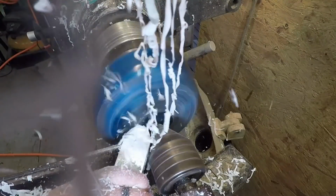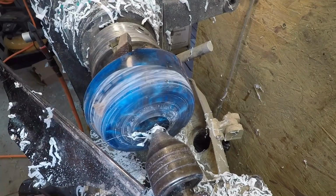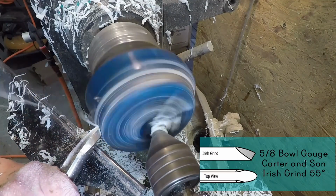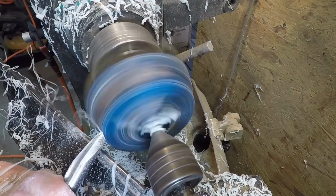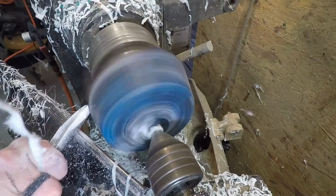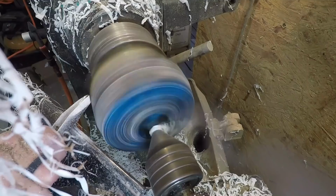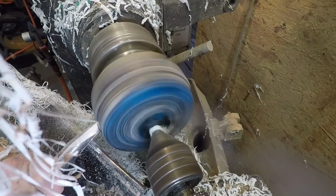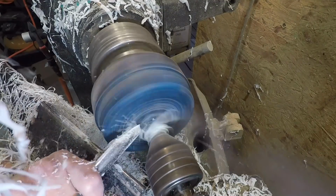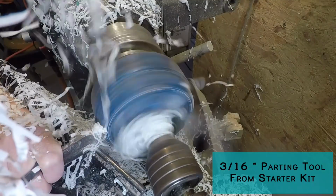So then the second coat, sometimes I will be able to use the fast set. You can use the 2-to-1 as your second coat. There's no problem. There's no specific reason other than the time. I don't want to wait 4 or 5 hours to be able to do anything to that piece. So I will use the fast set, which gives me a couple hours of jump time. So really, if you wanted to purchase just one resin to do your coats, you could do the 2-to-1 slow set, and that would be perfect. The fast set just helps speed things up for me, so I'm not having to wait as long for the second coat to finish. So yeah, that's why I do what I do.